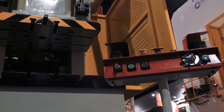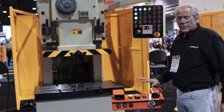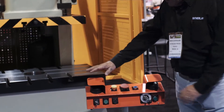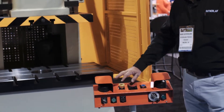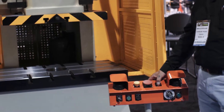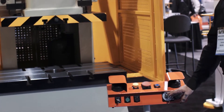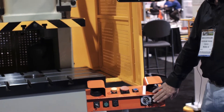Down here on the T-stand, this is an 88-ton machine. This is identical to the Sutherland as well, where you've got the two run buttons, yellow top stop button, red RAM stop button, control reset, motorized slide adjustment, mode selector switch, and continuous arming button in the T-stand.